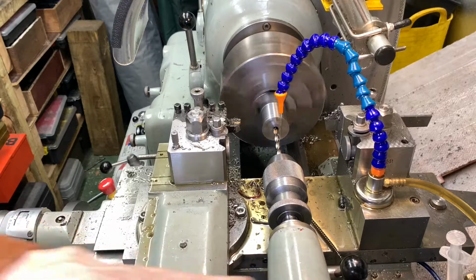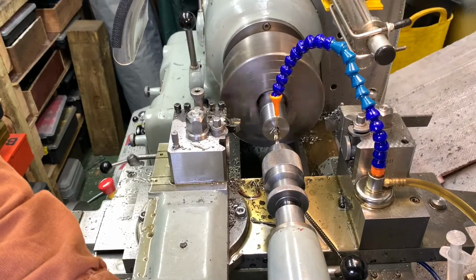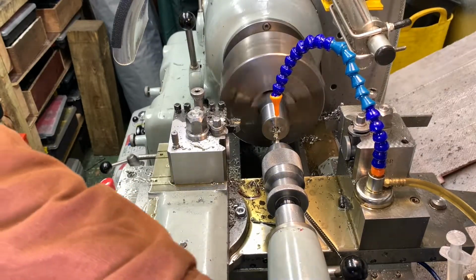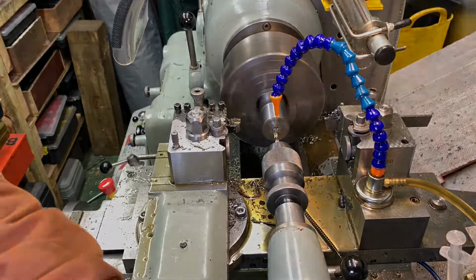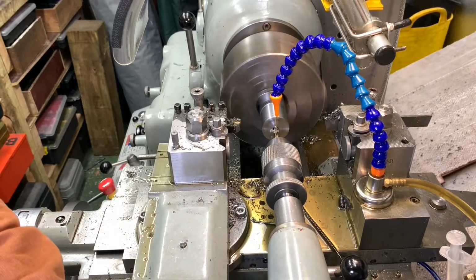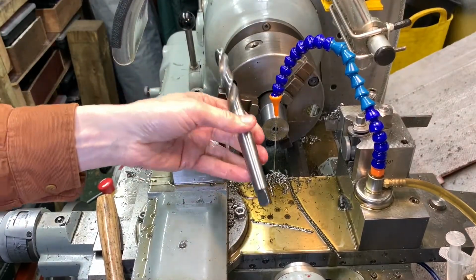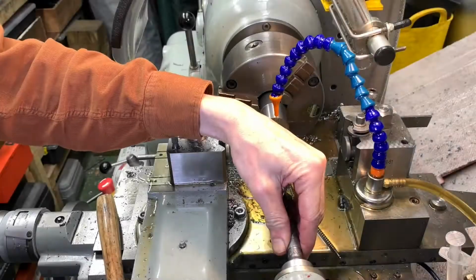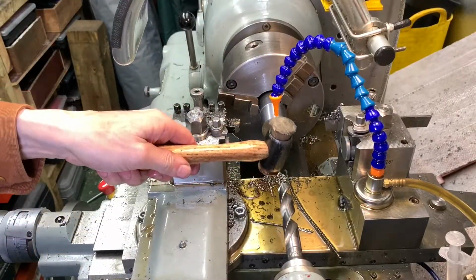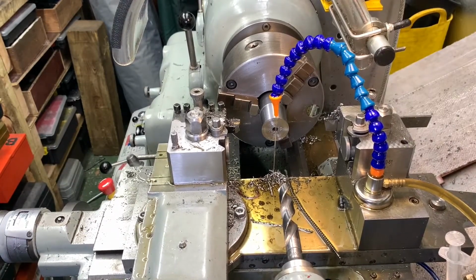We're poking a hole with a 1/4 inch jobber. I'm going to about 1.5 inches with this, final hole about 1.25 inches diameter. Cutting quite nicely. Jinx it. So go for a Morse taper drill, 16mm. See how that goes, slow the machine down. About 200 revs.